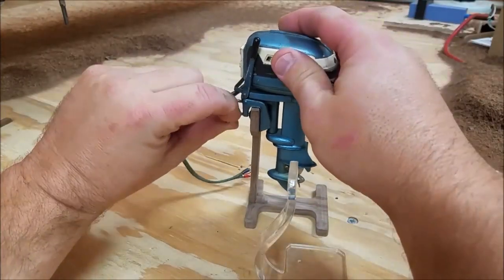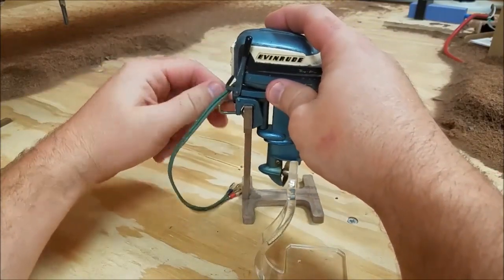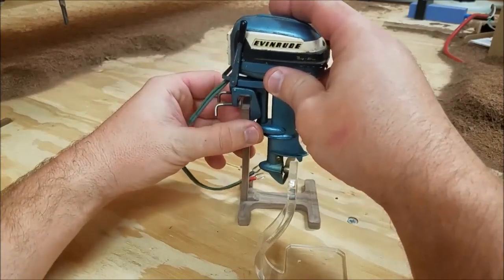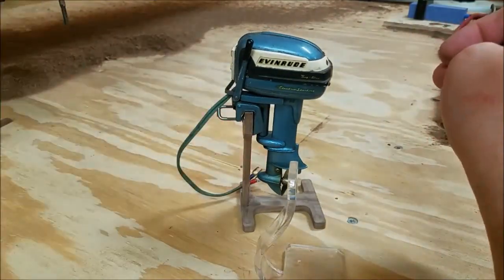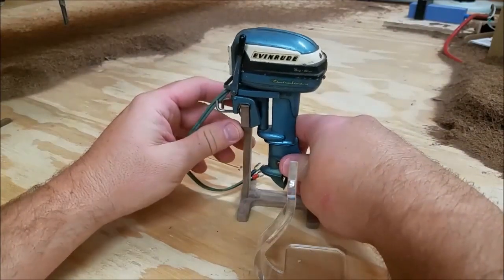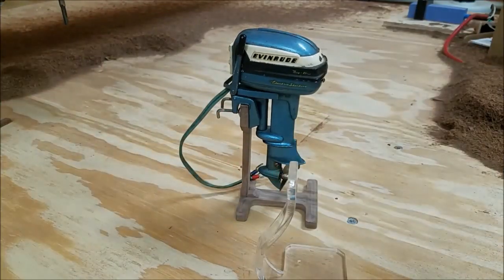The next thing, it's a little bit too wide. So this will fit on a piece of 1/4 inch material, but it's a bit tight. So I think I'm going to reduce it a little. Instead of going a 1/4 inch thick right here, I think I'm going to do a 1/5 of an inch thick, or 0.20. I think that'll make it so these little transom clamps work a little better. So, back to the drawing board.